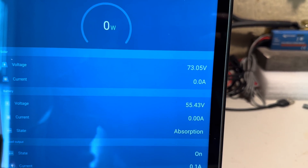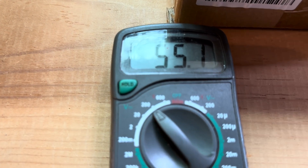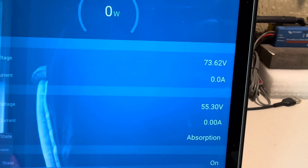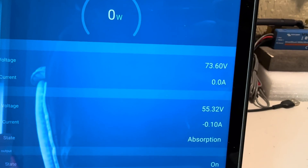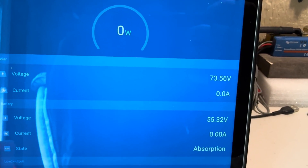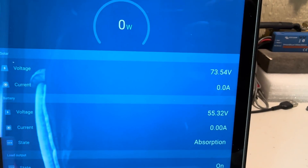The app is reading the battery voltage at 55.4, and the multimeter at 55.1. I was just looking at the instructions for that Victron 120 we've got tied up right now, and it actually says 12-volt, 24-volt, or 48-volt systems — you can configure it. I thought 36 too, but now I don't see it. Anyway — 12, 24, 48. You can see that voltage is starting to settle down a little bit. Hopefully it'll drop all the way down to 55.2, and I'm hoping I can see one or two watts of solar coming in to hold it there. But it's still not quite there to even allow any solar in.